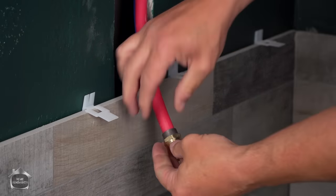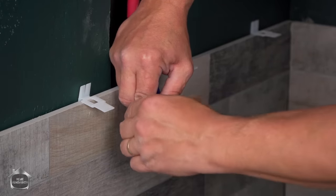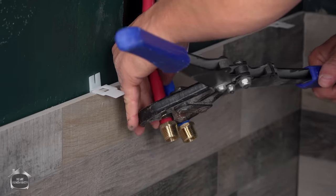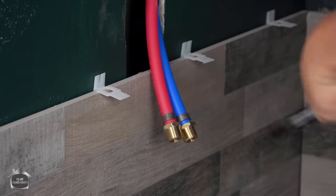Now these fittings are designed for half inch PEX, and that is a half inch male thread. Standard, okay? Nothing special here. The unit that comes with the shower tower is a half inch female thread, and these are standard and compatible.